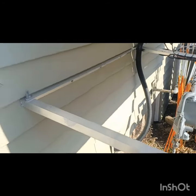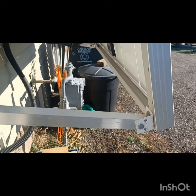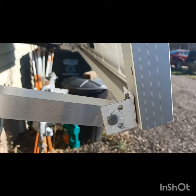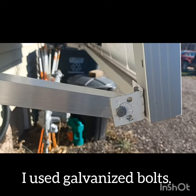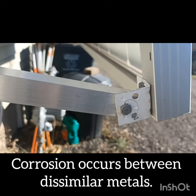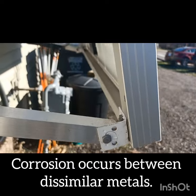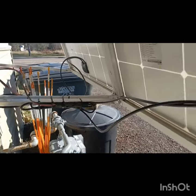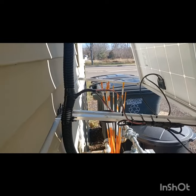You can see here on this side too is some more of the bracket setup. They do make brackets for these things, but it's just cheaper for me to use aluminum. You'll want to coat your connectors if you have aluminum and steel together — the panels and L-channel are aluminum, but the brackets are steel, so you want to put coating paint on them or something to protect them. And then you can see in there I've got everything all wired up and attached. The wires I made up myself.